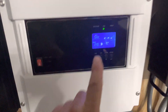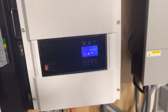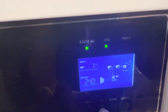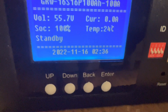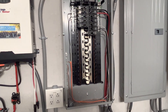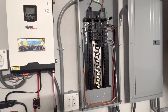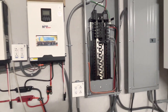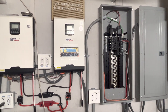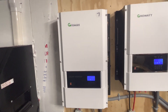This isn't even having to kick on at all right now, but this one is staying fully charged. I had this fully charged yesterday and you can see right now it's just topping off. I also have this one if I needed to — that's sitting at 100% state of charge and it's in standby. Right now we're heating our pool at about 55 degrees outside and 51 degrees in the pool. We're hoping to get it up to 60 degrees today, then over two days get it to 70, another two days to 80, another two days to 90 degrees, and then we'll be able to keep it there. Right now it's just running constant, but once we get there we'll be able to use that little 18,000 BTU to help supplement.